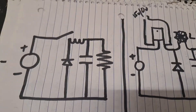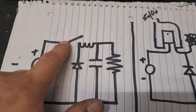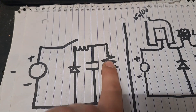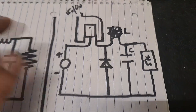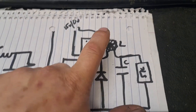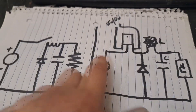Starting with just the buck itself — this is a common example of what you'll see: you've got a supply positive and negative, a switch, an inductor, a capacitor forming your LC filter, an output load resistor, and a rectifier. What that actually translates to in drawing form is your switch right here, a crappy toroid, and a 5k output resistor.